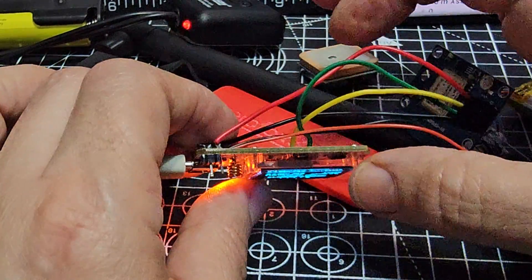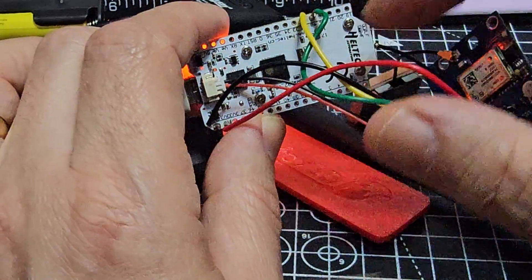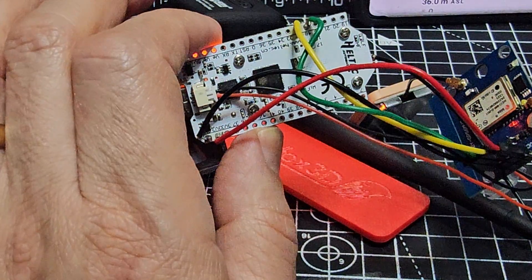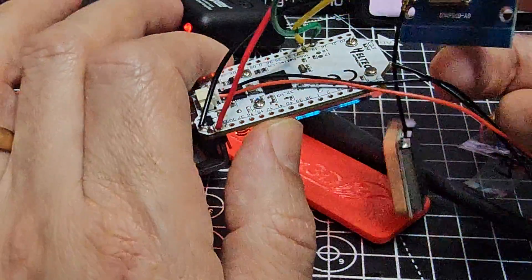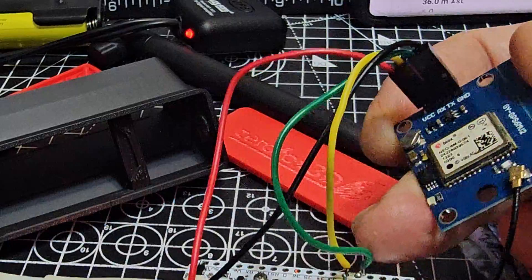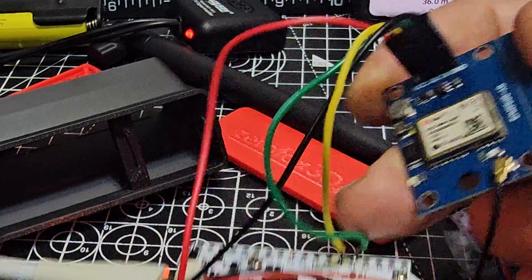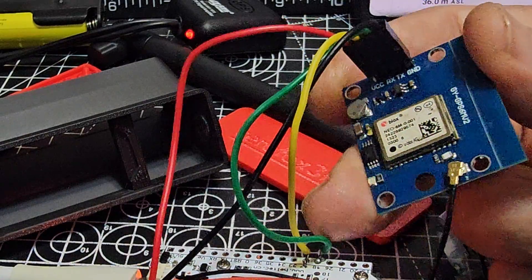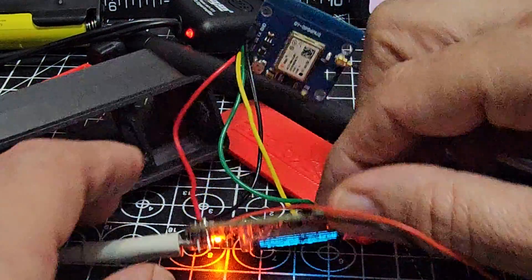If we turn it over, there are pins — you've got pins 47 and 48. Follow the colors if you can. Looking at the markings on this board, they do explain themselves: on the green you've got TX, on the yellow you've got RX, then you've got voltage which says VCC on the left, and ground on the right which is black. So: red, yellow, green, black. That board is connected to the GPS antenna.